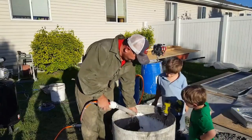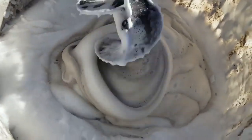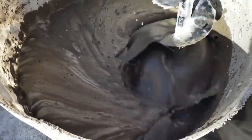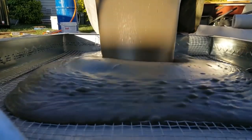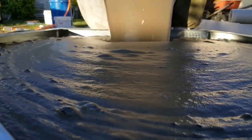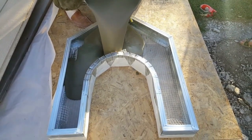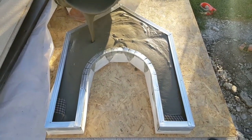The next thing to do to prepare is just mix up your wall panel mix design, inject your foam into it, then I use a big drill with an auger to mix the slurry up. Once your slurry is homogeneous and evenly mixed, you commence pouring — this is kind of the fun part. You just pour it, give it a jiggle, watch it level out, and let it sit about 12 hours or so until it has a skin on it. Then I typically put a tarp or another piece of visqueen over it to keep the moisture in while it cures for a couple of days.